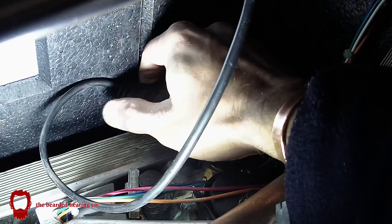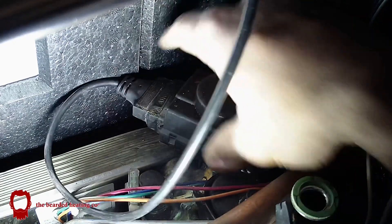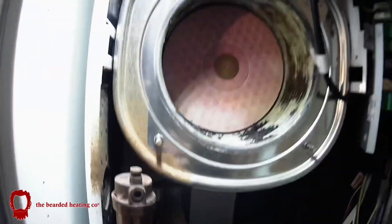The cable has been dried with a hairdryer and I did a continuity test between the cables end to end — there was no more continuity between the connections. As you can see the boiler's seen better days.